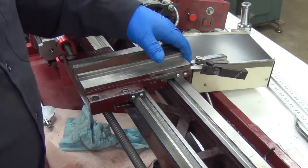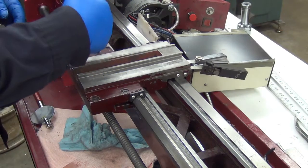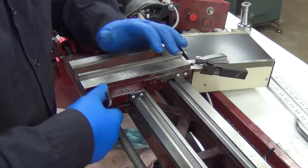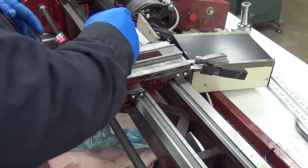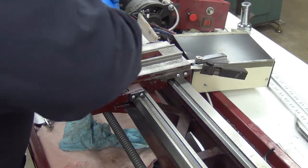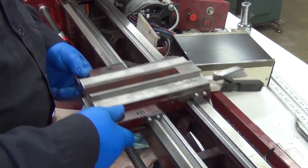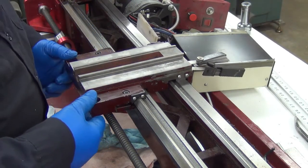If I take the shims out, just like on this side, there's no shims, and I tighten it up just even fairly snug, oh, I cannot move it. So I'll be shimming both sides today. That will be the thing. And I got to looking at it too, and something that bothers me is that, see, I got play in it this time because I loosened them up too much.